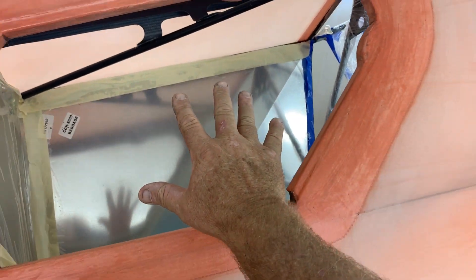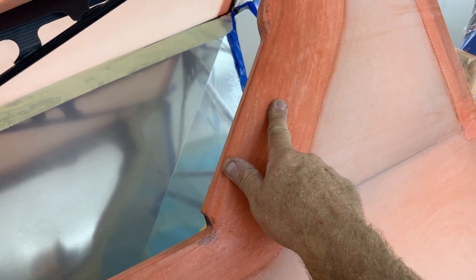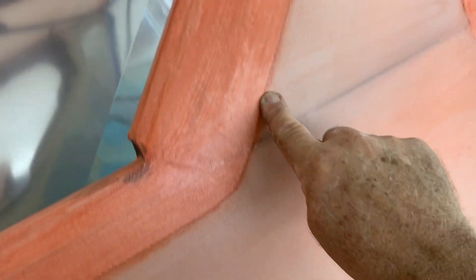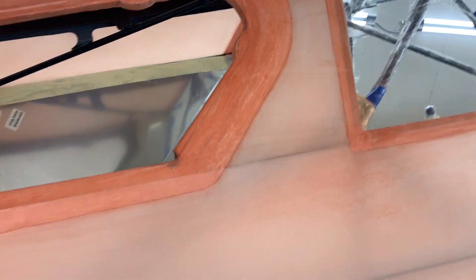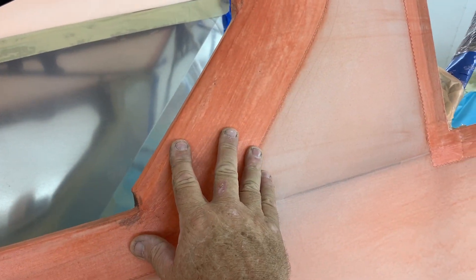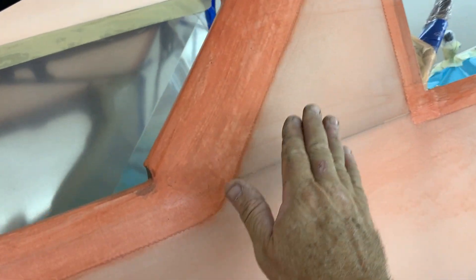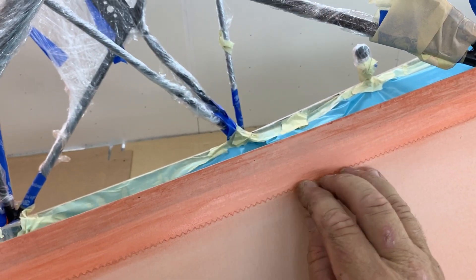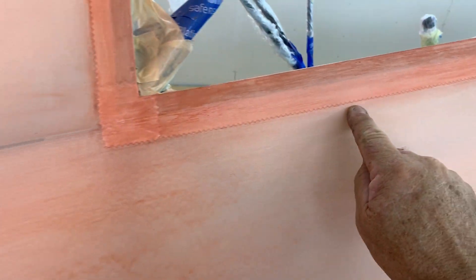Here you're going to have a carbon fiber door; here you've got carbon fiber behind fabric with a piece of metal along here. No matter what you do, you're always going to see the difference with the paint. But if you start messing around with the edges of poly brush and anywhere that poly brush starts looking shiny and thick, it's going to show through on the paint — you'll actually see it under the paint as a slick area. So the last coat I put over the tapes, before I sprayed and brushed the fuselage, I took a rag and MEK and cleaned up any excess poly brush around the edges for a nice transition edge.